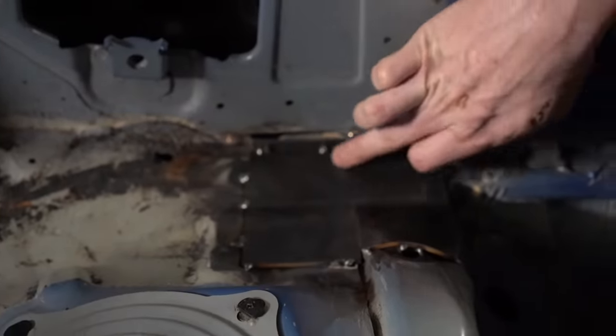So right now I'm measuring for a NASCAR style door bar. So we are using a ratchet strap here as our straight edge. You can see it's pretty tight. You can use masking tape for this. You can use a number of different things, string, whatever. It's just a reference for the outside of my tube. So I'm going to measure to the door skin to the outside of my tube. I'm getting approximately 7.5 inches outside to outside. So that means outside to outside, when I move that in, my center to center distance is also going to be 7.5. So when I go to my Bentec software, I'm going to plug that in as my measurement.